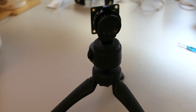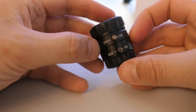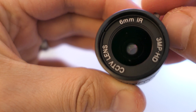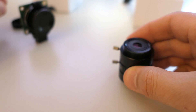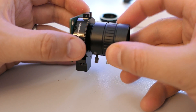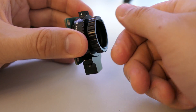I'm using a small tripod here but it could easily be set onto a full-size tripod. In this box we have the wide angle camera lens. We have two thumb screws on the top of this lens — the front one allows us to change the iris of the lens, allowing more or less light in, and the one that says near or far allows us to change the focus. To connect it up we just unscrew the dust cap at the back, take off the C-CS adapter for this wide angle lens, and then quickly screw it on.